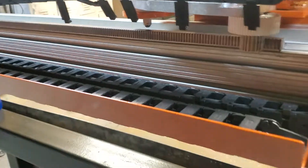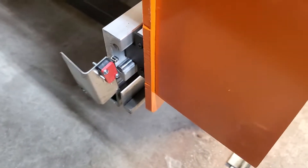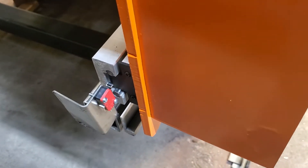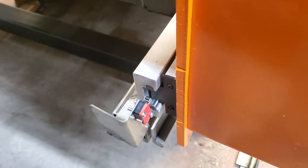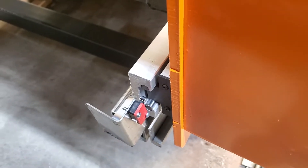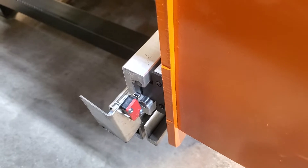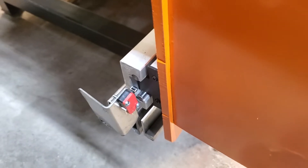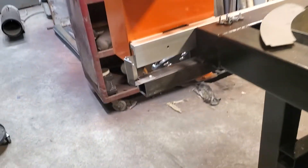I got these ready to wire up. I also got some little brackets made for the limit switches where they'll roll out and hit it, but they're kind of springy so they can give a little bit. On the other table they were solid, and if it ever hit them hard by accident it would bust them every time. These ones are a little flimsy — they give — and I've got one for each side.